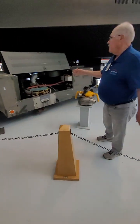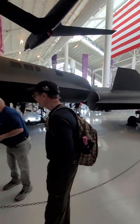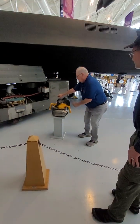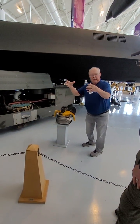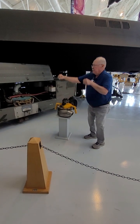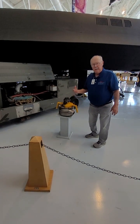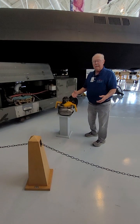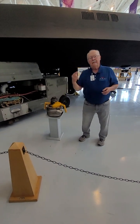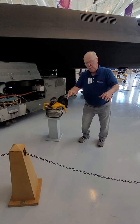So this is a Buick start cart. In the early days of the program, we didn't have air — this is an air starter, by the way. This is what we ended up using in the latter days of the program. You bolt one of these up to the gearbox. There's a little panel that opens up on the bottom of the nacelle, and it exposes the mate to this drive gear. You snap that starter in place, you hook up two hot air carts to it, and you can generate enough spinning force, enough torque, to be able to start the engine. The engine needs the equivalent of about 600 horsepower to get spun up to 3,000 RPM, at which point it will start on its own.